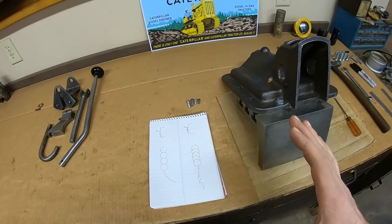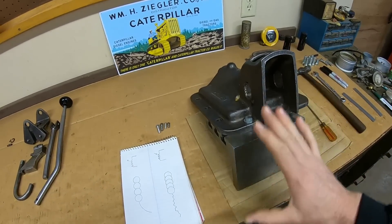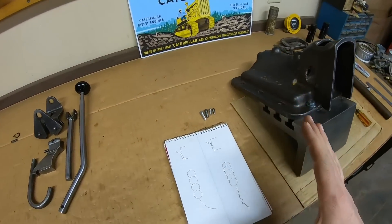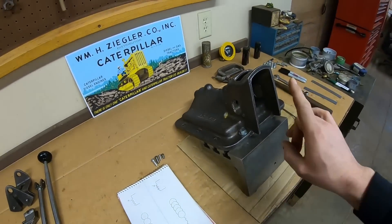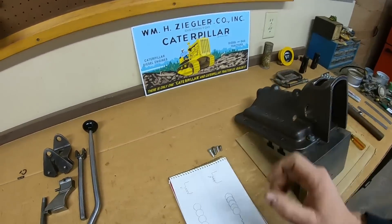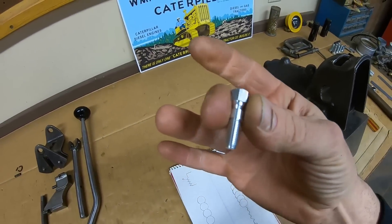Our modern methods have been refined quite a bit over what it originally was. Lock and stitch is probably the most popular premier method of doing this, and we're just doing the stitch portion — we're not worrying about locks. Here are some lock and stitch screws. They make them in all different sizes and different materials.